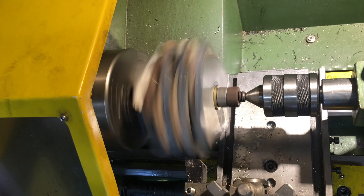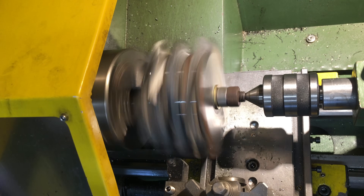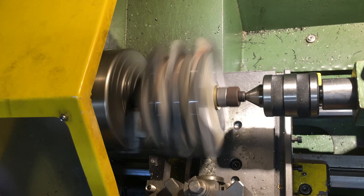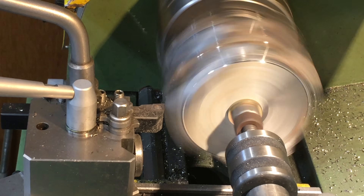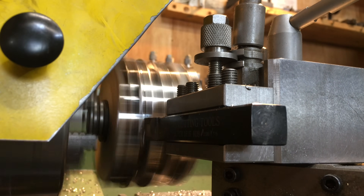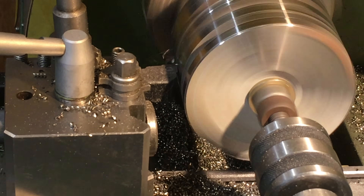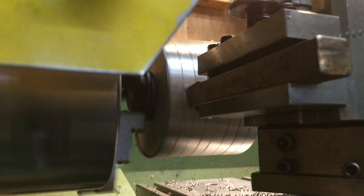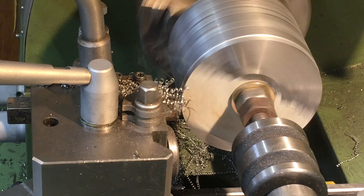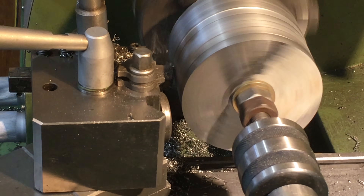The tool I used was a neutral 1204 12 rhomboid insert tool. I would have used a 1.6 rad insert but I was out of stock. This is a KC850 insert — they are very tough inserts but they're not very hard, meaning that they can take the hammer longer than most inserts but they do tend to wear down faster. My little lathe isn't very powerful so I was restricted to 20 thou depth of cut throughout — that's about 0.5 of a mil. I can hear some of you asking why I'm not using that South Bend 13 lathe, but I had another job in it.